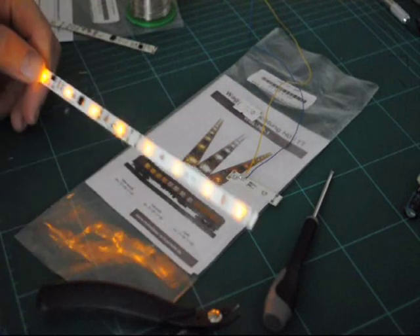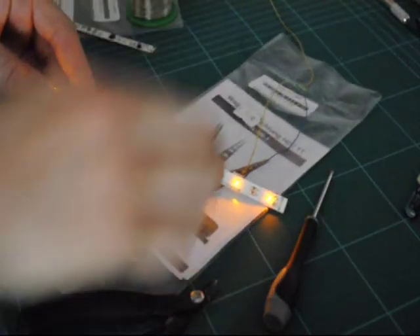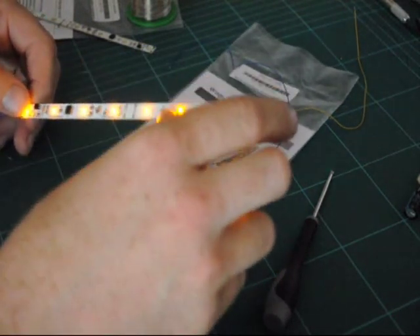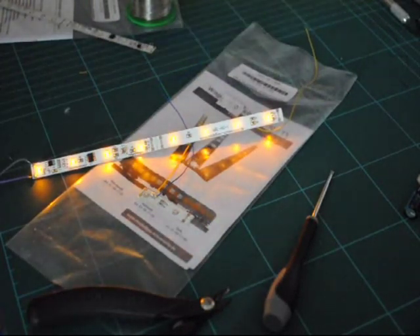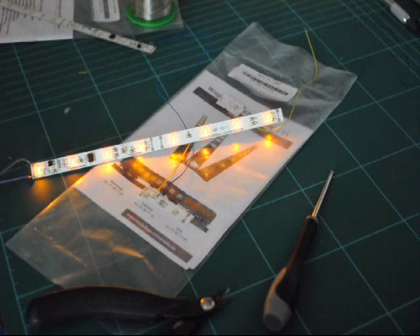So that is using it with just straight power to the board. If you want to use a decoder attached to the board to turn individual sections on and off — after you've cut the sections, if you had a four or five function decoder, you could use three of the functions: function one for the first part of the board, function two for the second part, and three for the last part. If you then wanted to put tail lights on, the fourth function could handle those. So there are loads of different ways of using this one lighting board. Thank you for watching — I hope it was helpful. I'll show you at a later date how to wire it to an accessory decoder and turn the lights on and off via DCC control.